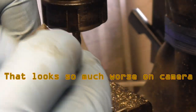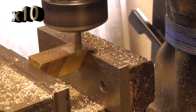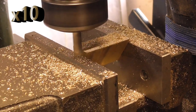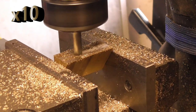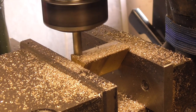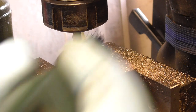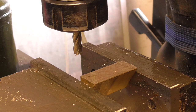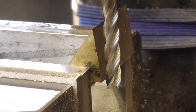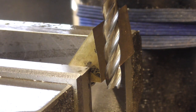That doesn't look too bad - nice and smooth, that's for sure. Right, so that's both of them done. Let's put them in level now. I've swapped out for a longer end mill and as you can tell I've assumed the right approach - I've levelled it off and I'm just going to mill the side of that off.